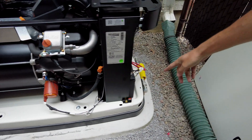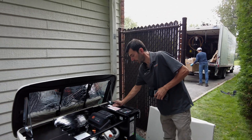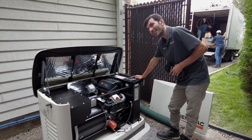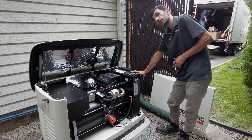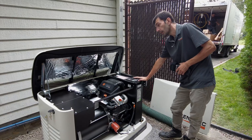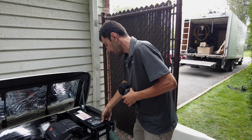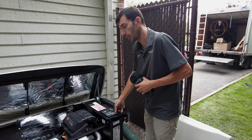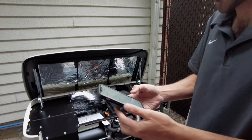The first oil that goes to the engine is kept warm by the cold weather kit, and there's also one for the battery so it doesn't freeze in winter. The breaker has to be always on, otherwise there's no power going to the house. We're going to install the app called Mobile Link — in the app you'll see how many hours it worked, maintenance reminders, and any errors. Do you know the Wi-Fi password?